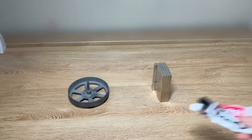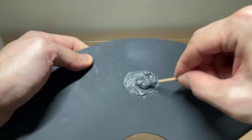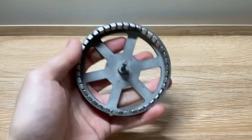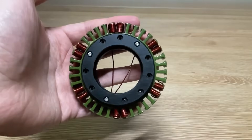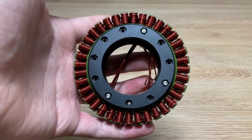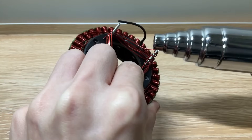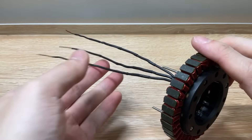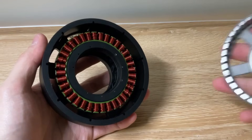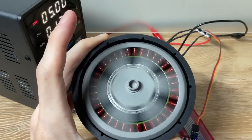Let's get started with the assembly. First, I'll attach the magnets to the rotor using adhesive. Neodymium magnets are extremely strong, so it was quite challenging to separate them. I'm placing the magnets with alternating polarity. Once that's done, the rotor is complete. Next, I'll prepare the stator — I'll wrap 20 AWG magnet wire to form coils. For detailed instructions on winding, please check the link in the video description. Since I'm using a star connection, I'll remove the coating at the ends of the wires, solder them together, and then install the cover. I'm currently using 20 AWG wire, but to reduce heat I might switch to thicker 18 AWG in the future. Once the stator and rotor are ready, I'll test the motor. Using an inexpensive ESC, it spins smoothly, meaning the basic motor structure is complete.